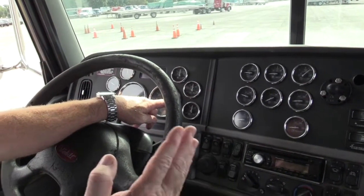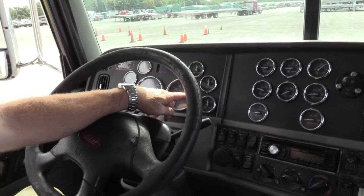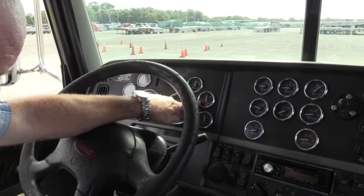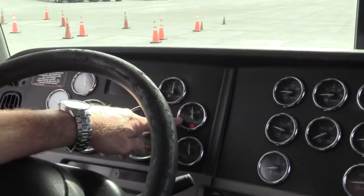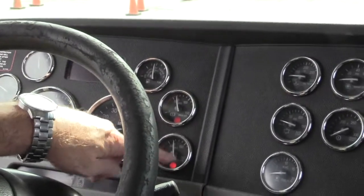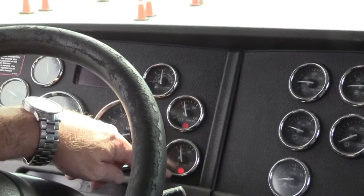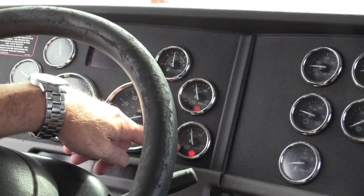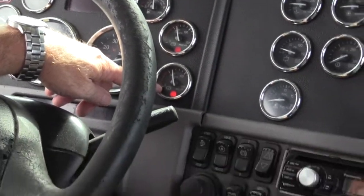This gauge has a delay in it since it's electric. All right, we're at about 66 and nothing yet. All right, our primary just gave it to us right around 60. We need to get it on the other one. All right, we do have low air indicators. Now I'm going to continue to fan the brakes, and somewhere around 40, both of these buttons are gonna pop out.